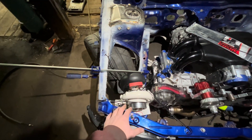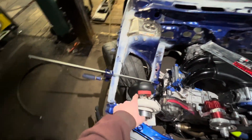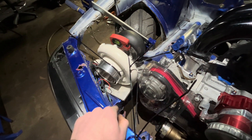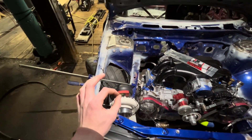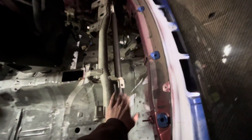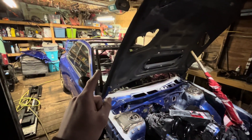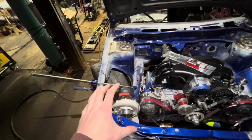What we did with the zip ties is pretty much just tied it all up in position. I also had to use this clamp and this piece of plate as a spacer to keep the compressor housing off of the frame. The reason I like to use zip ties is because it offers a very fine degree of adjustment. I use it for bars, holding bars in place, dash bar, roof hoop — if you're building a cage. Check out the Fab Jobs playlist, which I will link in the description. It's a really nice way to get stuff exactly where you want it.